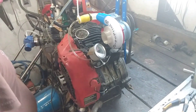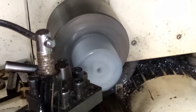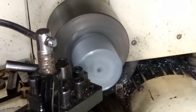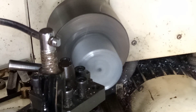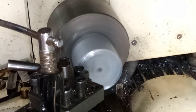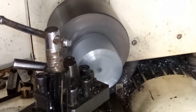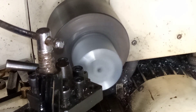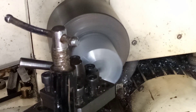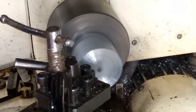That being said, I'm going to have to do something about the gearing. To effectively change the gearing, I'm going to put a smaller pulley on the supercharger itself, which should get me about 15,000–16,000 RPM when the engine is at about 4,000 RPM — just over the maximum recommended for these engines. I start off with a cast aluminum piece that I cast myself out of a bunch of scrap — hooray recycling — and I'm going to machine this into a two-inch pulley that fits a belt and my supercharger.